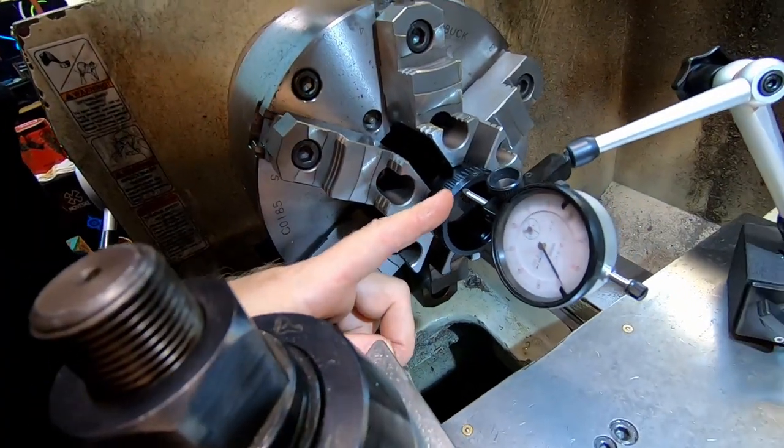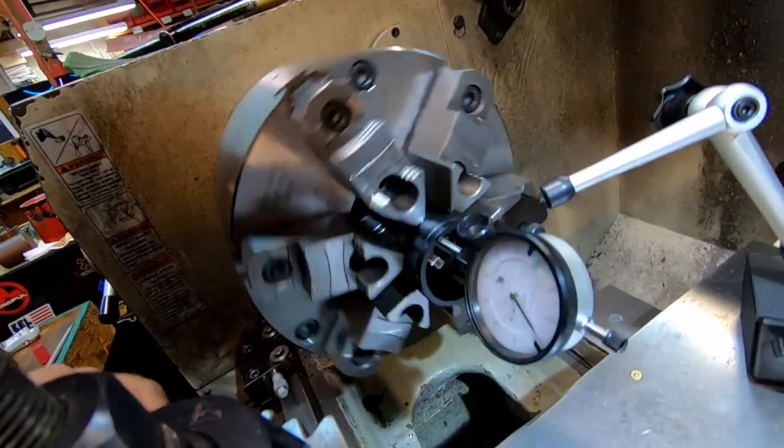I've got the M42 mount socket in the lathe. This is something people fail to do - a lot of times they'll just throw it in and start machining. But I've put an indicator on the face of the part and dialed it to where there's almost no runout. What that allows me to do is machine the part true. I've already tightened the chuck so now I can take my indicator off and machine away the excess metal. I've got to take about 350 thousandths off the face to get the lens seated deep enough into this mount so it'll couple up to the camera properly and I won't lose infinity focus.